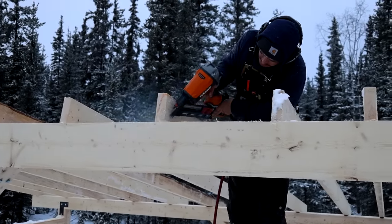And how it's gonna be built is the roof is gonna be built out of 2x4s. You can see I've got a string on here to kind of get these lined up. This was kind of difficult for us to do. In the end, what we ended up doing was we used this little triangle tool that gives you an angle. So we put one up, we liked it, we took the angle, and we were able to put four up, and then we've tied a string along this. We need to tighten this string. It's been sitting out here all night, but when you tighten this string up, we should be able to go along and just put all the other ones up, nail them into those back rafters.